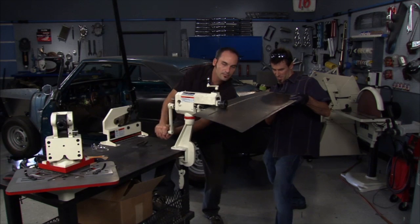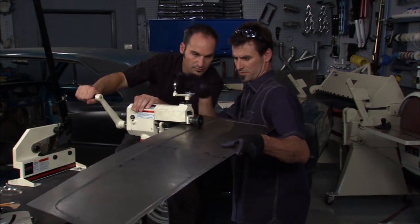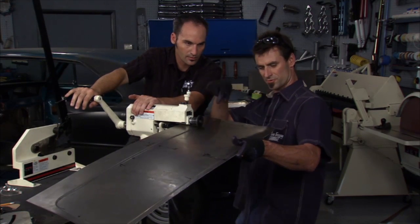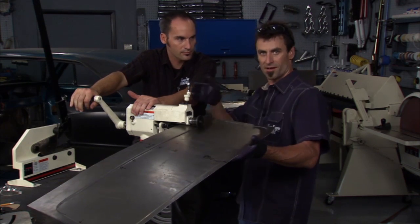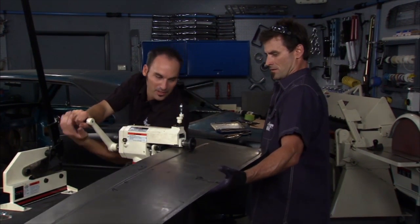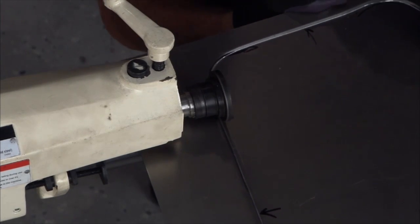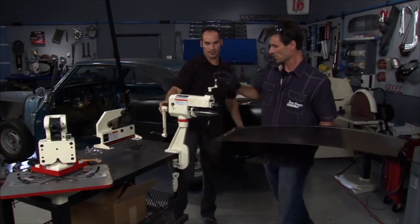We're putting a couple of beads in the panel. Birdman is getting it rolled down — this is the second pass. You crank down your depth a little each time so you're getting progressively deeper. The first pass is really light and easy to run, which lets you adjust your line if you mess up. If you crank it all the way down on the first pass it's really rough going. At the corners we slow it down so the backside of the sheet doesn't catch on the tool.